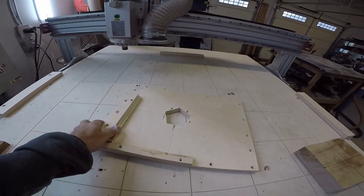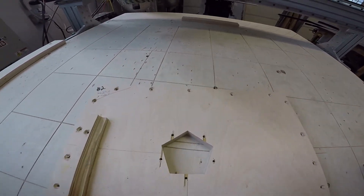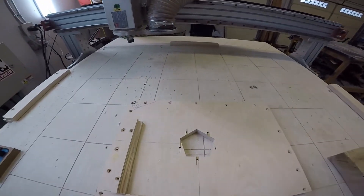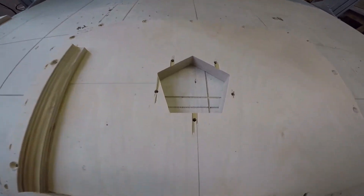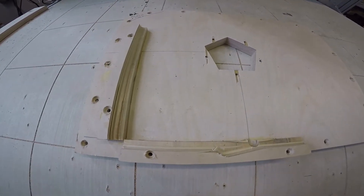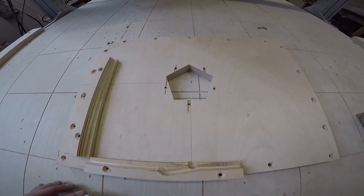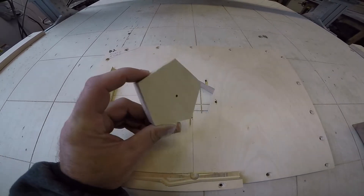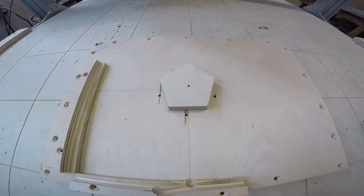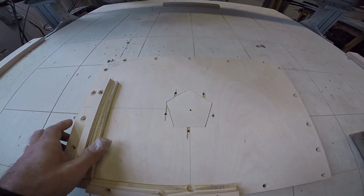This is a fixture that I've made — I've got several of them. It's just three-quarter inch Baltic Birch ply and I've strategically cut out a pentagon in the middle of it. I've got some lines on it to help me mark things up, and some guides at a 90-degree angle that I can put blank stock in if I'm making multiple parts or multiple pieces of the same carving. I've got a bunch of these pentagons cut out that fit nicely down snug.